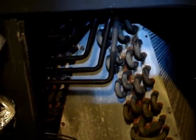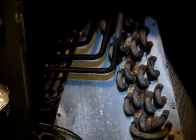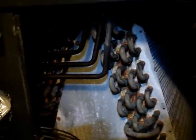This is the top section of the air handler. Since mine is downflow, this is on the top. This is the evaporator coil, which is the name given to the coil in the AC unit — although it serves as a condenser coil in the winter time. It's generally called an evaporator coil or indoor coil. You have the small connector tubes that run the length of the coil, and you see the aluminum fins run all the way down.